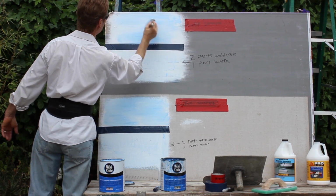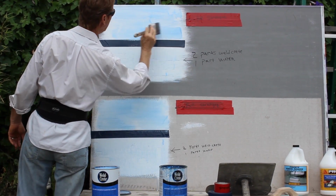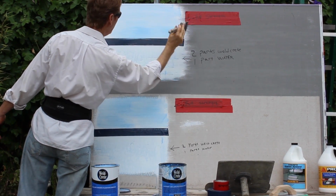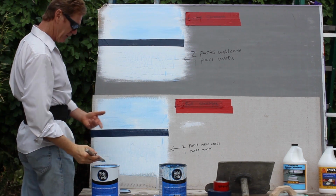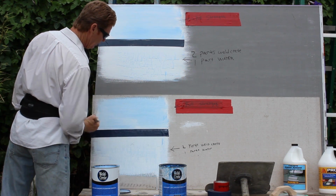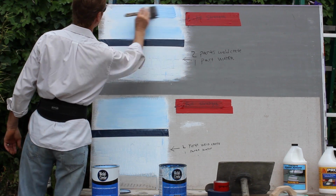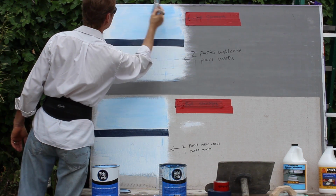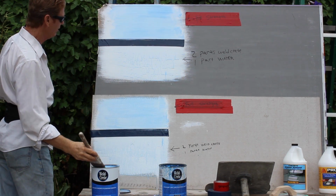Say, okay, this is heavier than this. Now, if you take a house that's been, say, 100 years old, it already has 20 coats of paint on, and some of those coats are extremely quality paints. Now, you put solid Weld Crete on it, and keep in mind, guys, what I'm referring to is a color coat, 1/8 of an inch thick. Everything on that can is for 1/2 inch. They don't mention color coats on that can because I don't know why, they just don't. But this is well known in the plastering industry, what I'm about to show you.